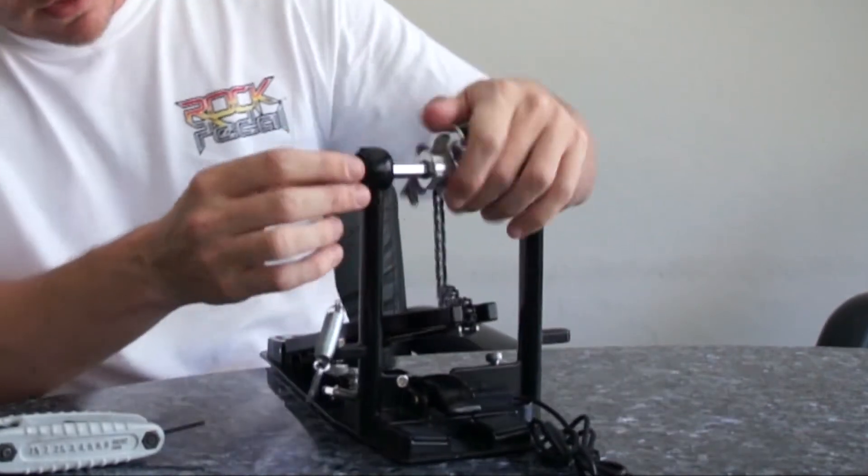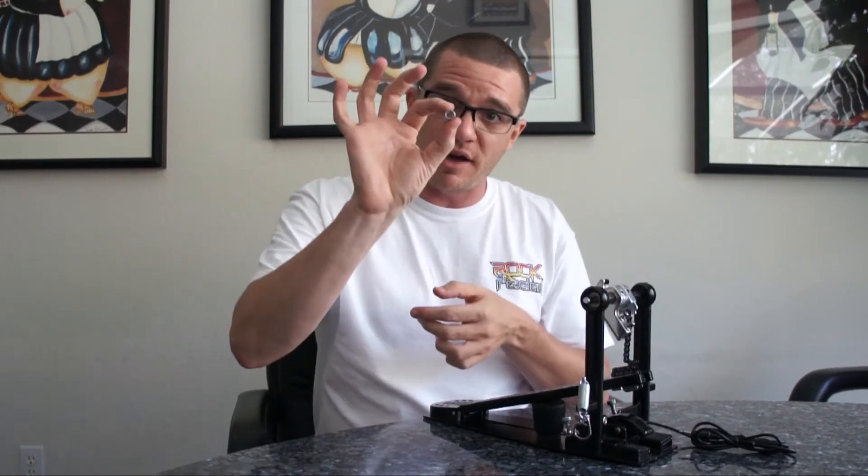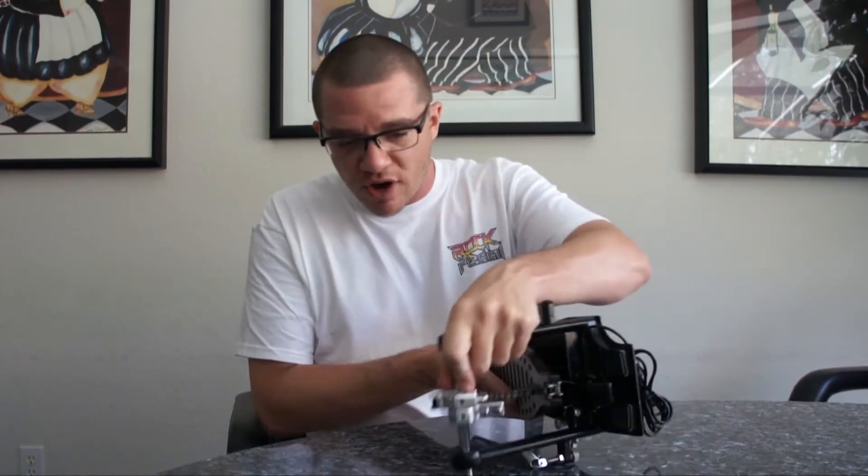So that's why we did this — now you can see the bar is flat-sided here. What's very common is for a little piece to fall out. Once you take off this piece, just hold your hand there, and a little spacer will come out. It keeps everything lined up correctly when putting everything back together — just take those two parts and put them aside. There's also another little disc with a hole in it inside; it's a guide for the metal bar. It may or may not come out — it's got some grease on it. If it falls out, put it aside; it goes back in either direction. I suggest working in a clean area so that if something falls out, you don't have to go searching for it.